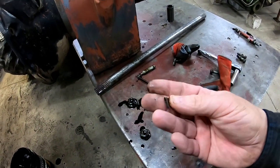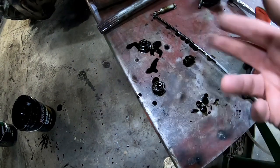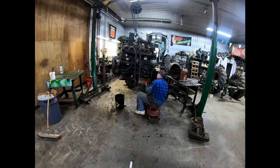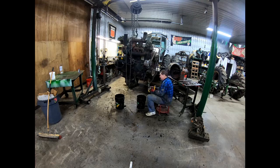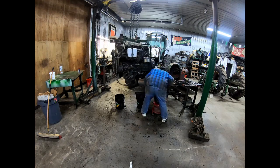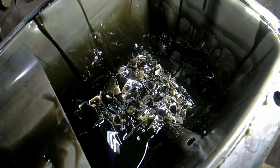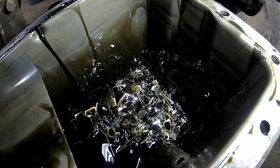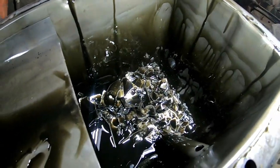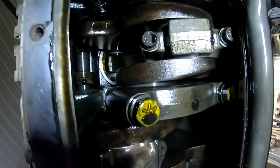Yeah, it's about the right thickness. I can see cross hatch on it. I think that's a piece of sleeve. Well, I don't know if that's, that's not good. I don't know if that could have made this happen, but it looks like the sleeve broke and fell down and just got annihilated. I would say the piston's still in there. I can't believe the blow-by didn't suddenly increase, but then again, I wasn't really working it that hard, just driving down the driveway.